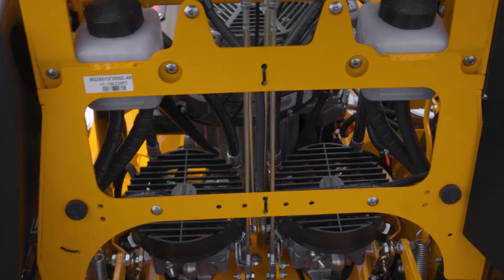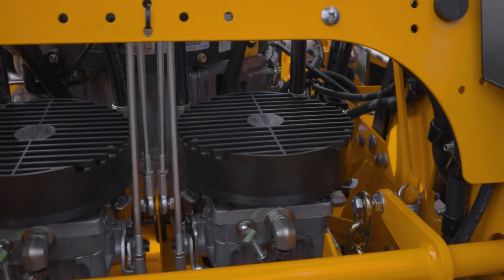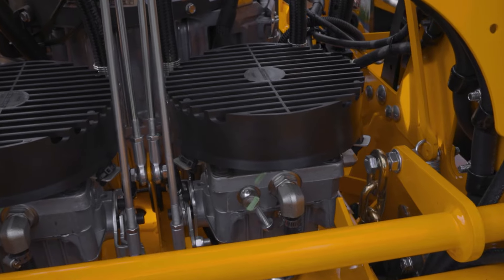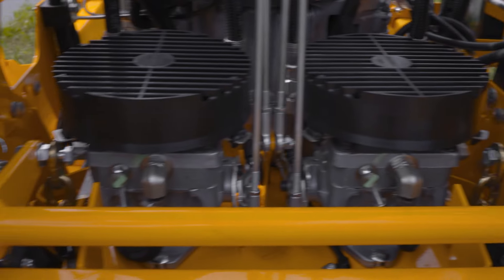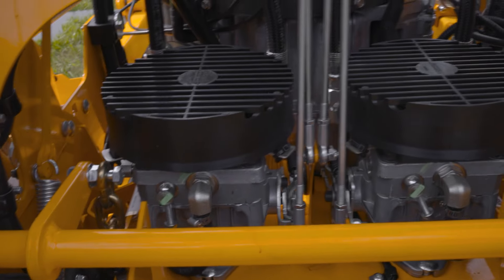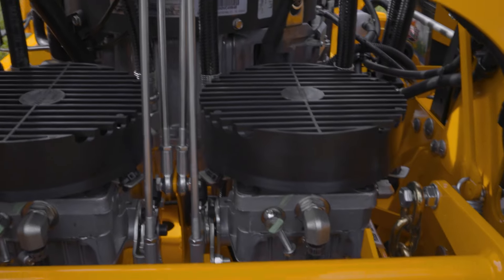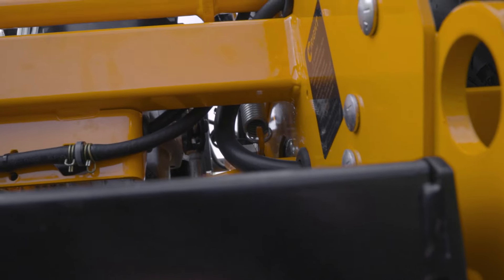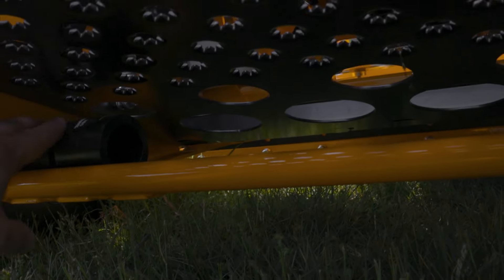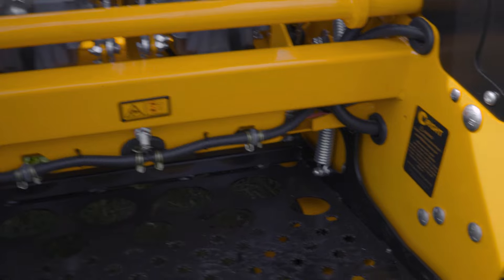Some of our newer models have moved to metal tanks, which are more costly, but we use a cap-into-coupler type setup there. The pumps are Hydrogear — very durable and reliable. This is your bypass, so you can unscrew these and push them around if required. The platform comes with four elastomers — two here and two on the other side — and that's actually a pretty stiff configuration. If you're a lighter operator, take out one or two and you'll get a much softer ride.